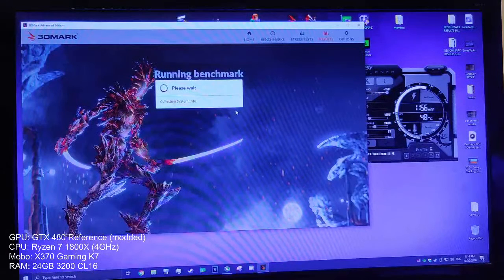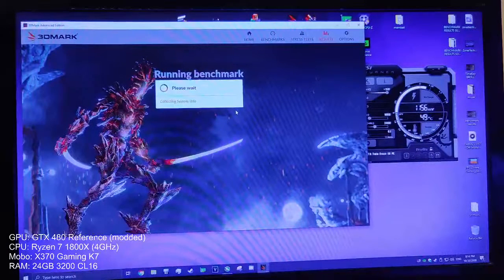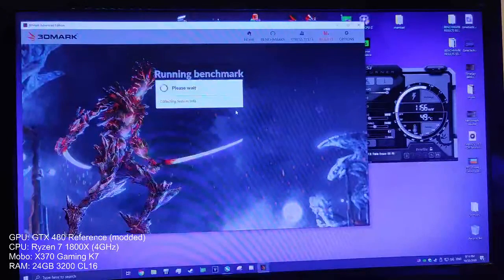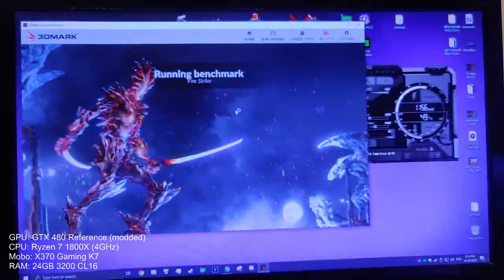They are all Samsung also. Like all of my Fermis except the two 580 reference cards that I have are Samsung. The reference ones are Hynix. And one of them is actually dead right now. Like I have to reflow that one again.